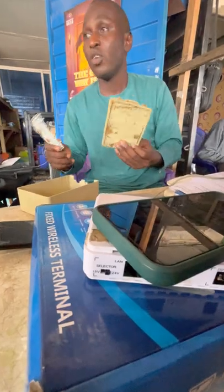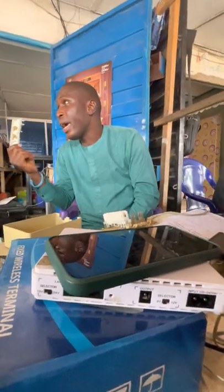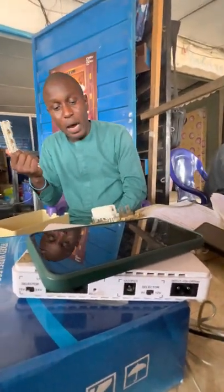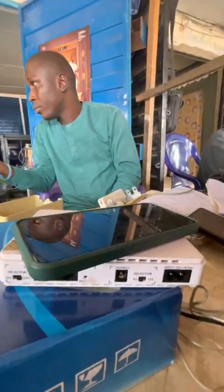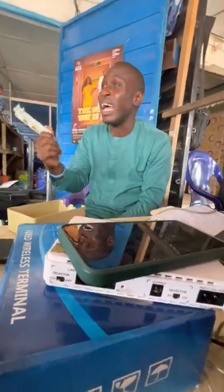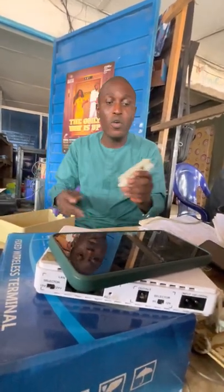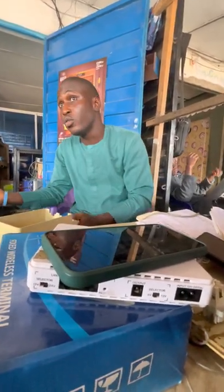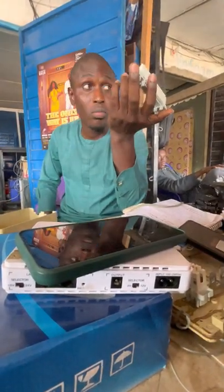So three things make up your MDF. Number one, this thing, we call it Krone, K-R-O-N-E. It's written on it. This is the Krone. This is the thing that actually performs every electrical contact. It's multiplex, so if you want to multiplex signal, demultiplex signal, or trace a fault where it has broken the circuit, this is what actually performs all electrical functions on your MDF.